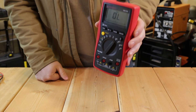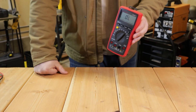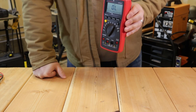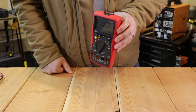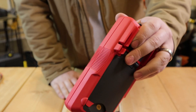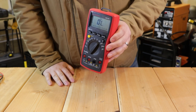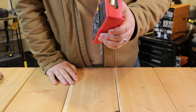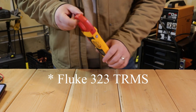The temperature on the AM530 seems to be a few degrees off pretty much all the time, as you'll see in the comparison at the end of the video. If you're doing precision work like troubleshooting superheat or subcooling, I'd rather have a dedicated thermometer. I've also had build quality issues with a dual-input thermometer from Amprobe that didn't even last a full year. On this meter, the rubber protection has open seams, so moisture can get in — working on rooftops and exposed to the elements, I don't have a lot of faith in this meter taking harsh abuse long-term.